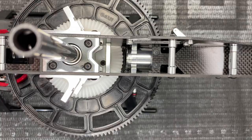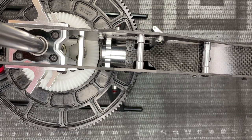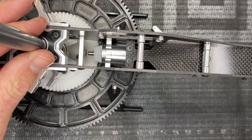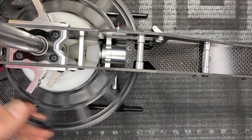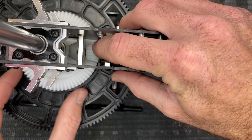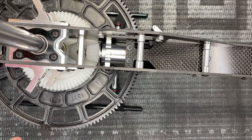I added one more 0.2 shim on the bottom and went ahead and tightened everything down. Test-fitting the boom again — shaft play seems perfect, just the slightest bit. Slide it all together making sure that pin slides into the front bearing block. Rotate everything: it feels great, slack in the gear feels good at the motor/engine end, and gear play at the actual torque tube tail gear is perfect — everything spins freely.